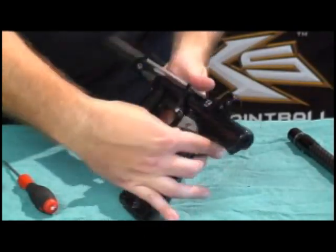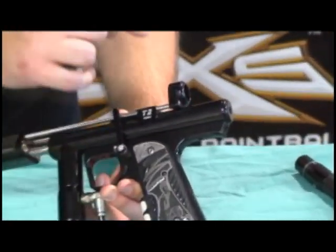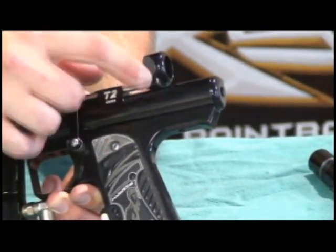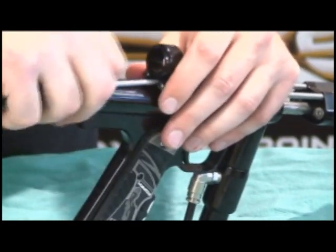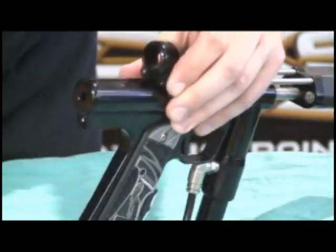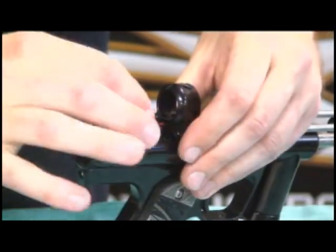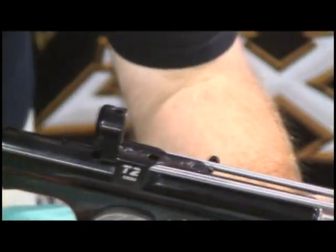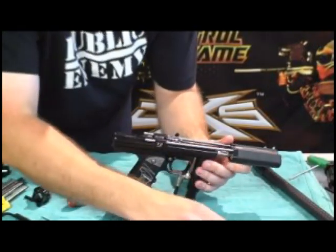Now, the next thing that does not need to happen, but I'm going to show you here, is taking this back block off. That's going to be two Torx screws as well. I wouldn't take it off often — if it just needs to get wiped down, this is basically all you need to do. But if you do need to, be careful when putting it back together — it can get some bind. You need to align that back block properly and then use blue Loctite to lock down those screws and keep them in place. It can be a little bit difficult to get the back block off — it fits really tightly. What I do is give it a couple of taps — nothing hard — and usually that loosens it up and the back block will come right off.